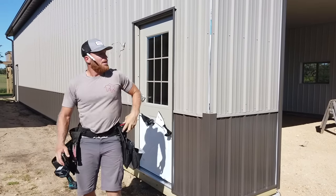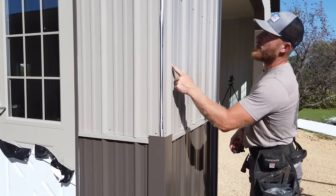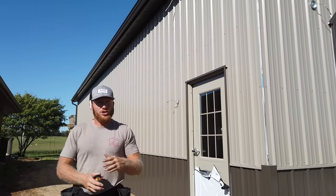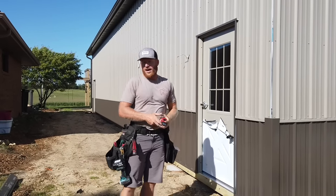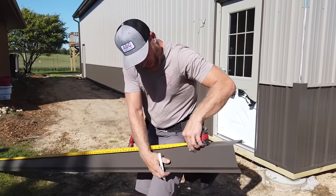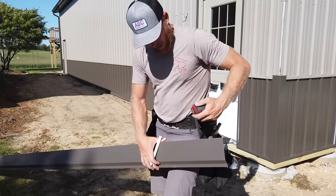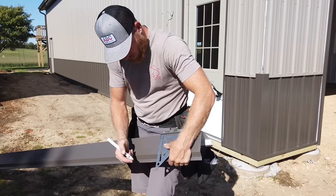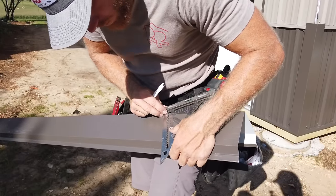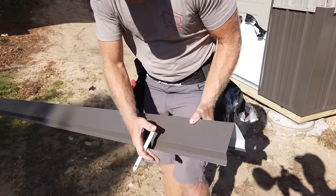I've already done the other ones on this building, but what I recommend is right where this piece of trim ends — which is right along this rib — you're going to want to get your dimension for your long point because this is a pitched angle up there at the roof line on the soffit. The other side should be the same dimension as your side steel. So we've got a 112 dimension on my sidewall side and the long point is 116.5. I'll mark those points on the edge of my steel, take my square — that 116.5 is this dimension way out here — and I've got a 4/12 pitch on my roof. So I'm going to put my square at 4/12, slide it until it's right on my mark, and mark it. That pitch I just marked is my soffit pitch.